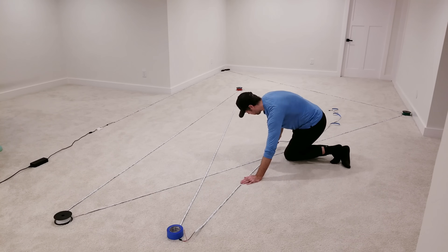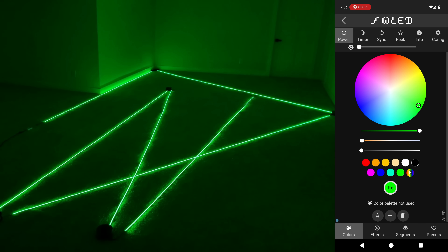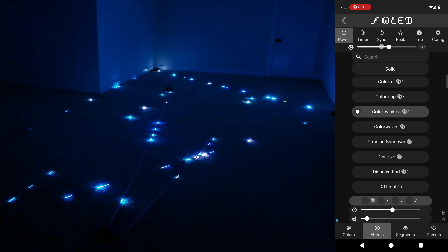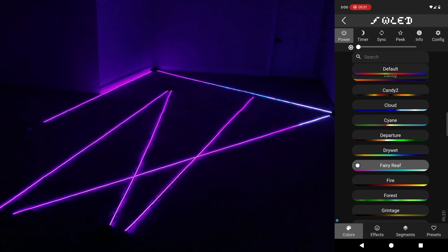Next I'll add a sixth roll for a total of 30 meters. I'll update the length to 480. Orange, green, and red look perfect without having to adjust brightness. When I put the blue teal color on it really struggles at this length and brightness, but I lower the brightness even further and to the naked eye it still actually looks pretty good. During certain animations that don't have all LEDs on at once you can increase the brightness without negative side effects. I've encountered zero data issues — everything is still snappy and responsive.